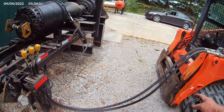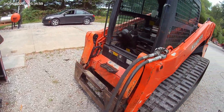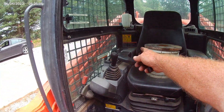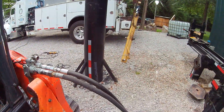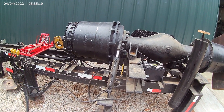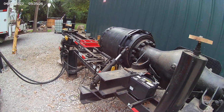What runs the whole thing is my skid loader. I've got these hoses here, pull my skid loader up, and I make it think there's somebody sitting in the seat by putting some tire compound and a piece of 1-inch plate steel in the seat. Turn it on, set the parking brake, and that's where I get my hydraulic oil from. It's not too complicated other than it's just big and heavy. I keep it under cover when I'm not using it to help prevent weather deterioration.